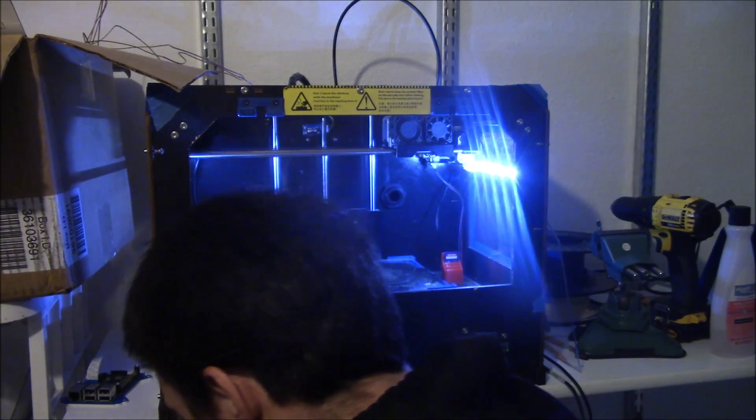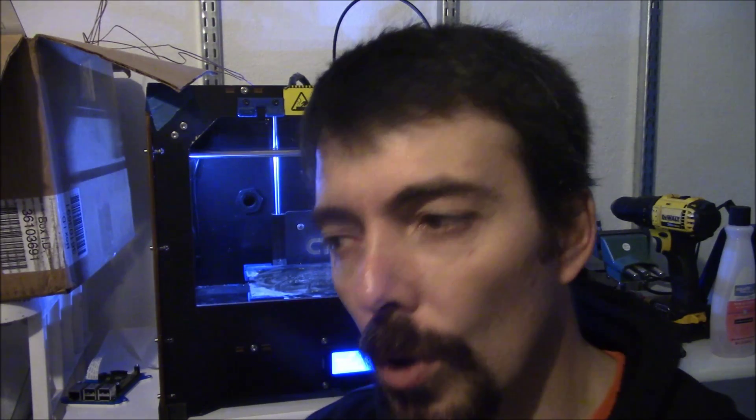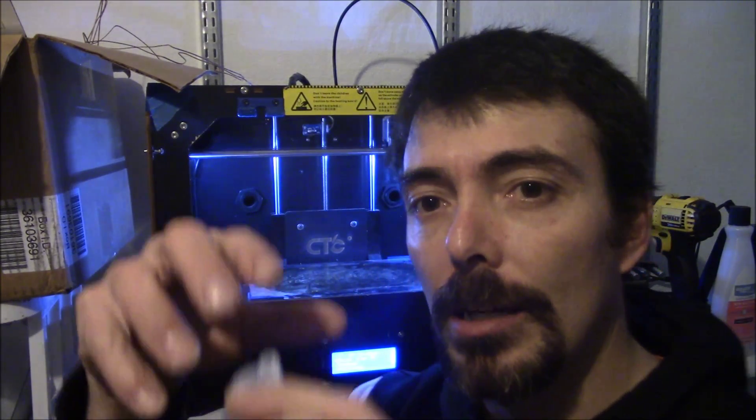There are two things I could have done to make these smaller prints turn out. One thing is I could have tried putting two on the build plate further apart from one another. That way the print head would have a chance to print this one, move over, print this one, giving the other one the opportunity to cool. When you watch the footage it's very evident that that is what's happening — it's heating up the print to the point where it just becomes jelly and mush because it's not getting a chance to solidify.